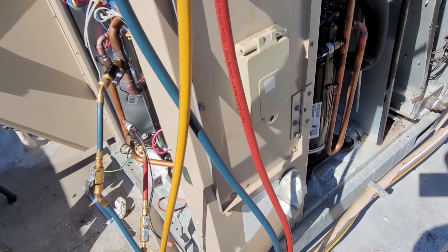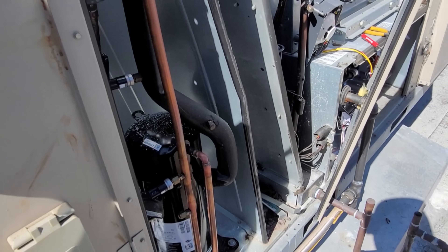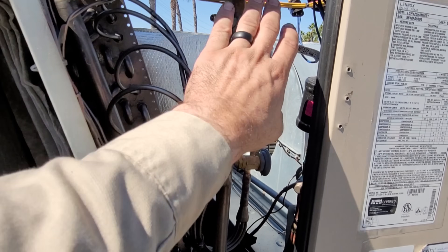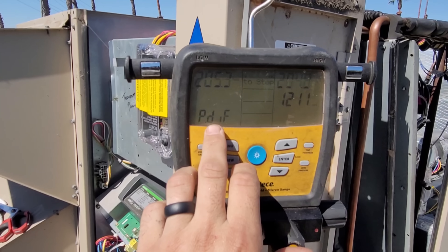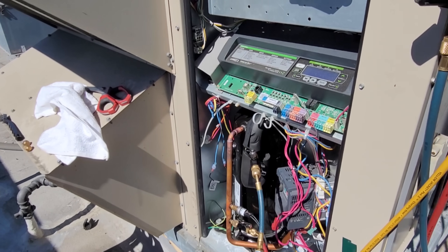We are doing a pressure test right now. I've got about 200-something PSI of nitrogen. I like to let it sit for five or six minutes and let everything equalize out before I hit start — because if you hit start right away the pressure can still fluctuate a PSI or two. We're just cleaning up. The dryer's installed; we used the wet rag compound so we're getting some of that off. We've still got to clean up because we used wet rag on the compressor too.